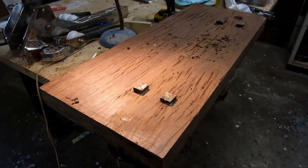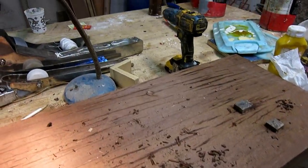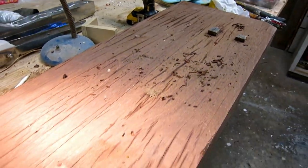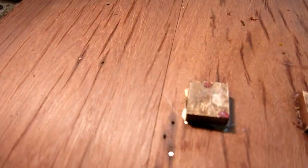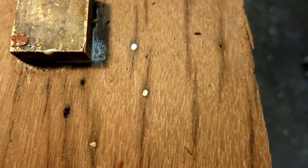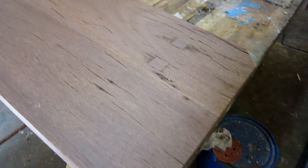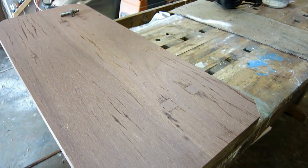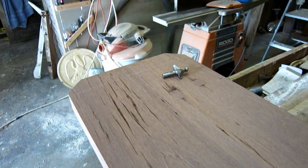I cut and pounded in a plug where the old bolt holes used to be and plugged the round holes on both sides. I'm going to run it through the planer again to get it flattened out. There are some broken bronze screws or nails in there but they don't affect my carbide planer, so we'll just run them through. I got the holes plugged and ran it through the planer a few more times to bring the thickness down.